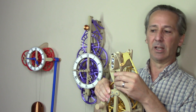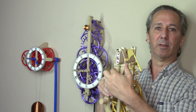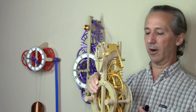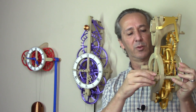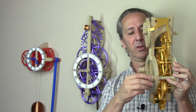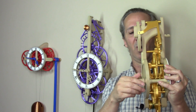If you're printing a new clock, then there's holes in the pendulum support for those set screws that are already there. The second improvement on this design is adjustable height standoffs so that the clock can be adjusted to fit against an uneven wall.